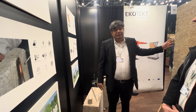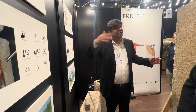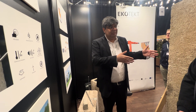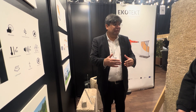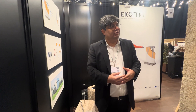How high can you build? We could go 10 storeys, 20 storeys — the higher we go, it's actually much better. Because these are lightweight — 60% lighter — which means the foundation required is also reduced by about 50%. Because with a lightweight structure, we don't need so much concrete in the foundation.